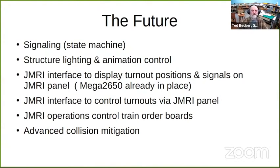The train moves into a detection block. It only sees the event when it enters, and it sees another event when it leaves. And so you need the state machine in the software to remember that block is occupied. Now, like I said, I back up by repeatedly transmitting that state, but it still needs to remember that.